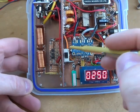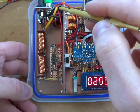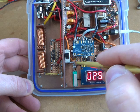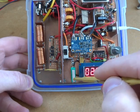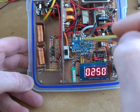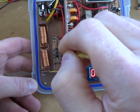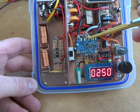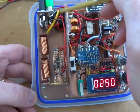So now the way it works: the PTT switch here, the transmit/receive switch, toggles the relay and puts the radio into transmit. The key down here is now just providing an earth to the microcontroller. The microcontroller is sensing that it's been earthed and in software it's turning on and off the output of clock 2. That means over here in the power amplifier through this red wire we have a fixed 12 volts on transmit. So the amplifier is on and just waiting for a keyed signal to come in to the front of the amplifier, gets amplified through the low pass filter and back out the yellow wire and out the antenna.